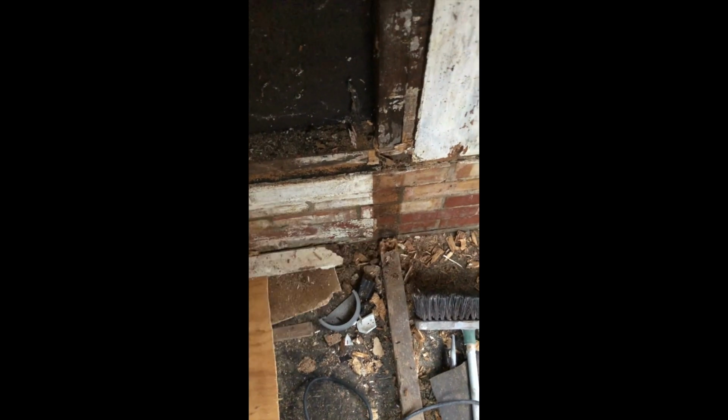So we're removing all the wood because it's a little bit rotten. That's the one I'm not happy with. My plan is I'm going to rebrace it up here. So in a way, drop the ceiling, plasterboard it, build a false wall along here, and obviously insulate it. Then I can brace it up from the floor plate onto the new plate and help with that. Obviously I'll show you all that at the time. We're probably going to keep the window in and scrub it up a little bit.